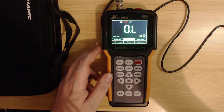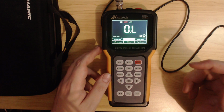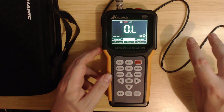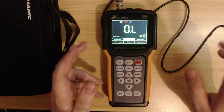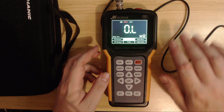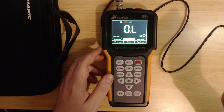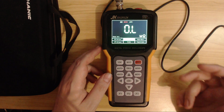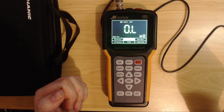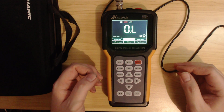The Vichy VC97, which is the cheap multimeter I normally recommend, has quite a bit of overshoot on the first sample that it gives you. When you first apply it to a 12 volt source, or roughly 12 volt, it gives you a reading up around 24 to 25 volts. The next reading after that is correct, and then it holds steady. So, seeing as multimeters aren't generally meant to be capturing impulse, like transient voltages, I don't think that's a big issue personally.